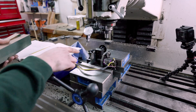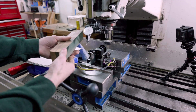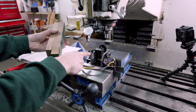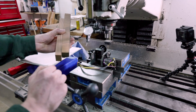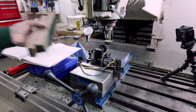The motor shaft gap: the back edge of this one is four thousandths farther back than this one, and the front edge is ahead by two and a half thousandths, plus or minus one thou. Hopefully you guys understood that — hopefully the blocks helped, because that one looks perfect and this one is very obviously not, so that should help.